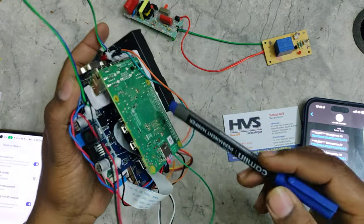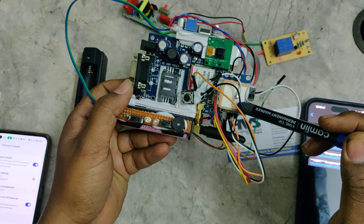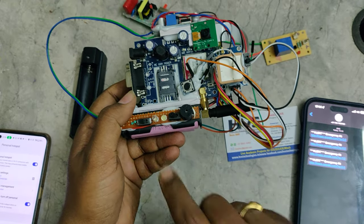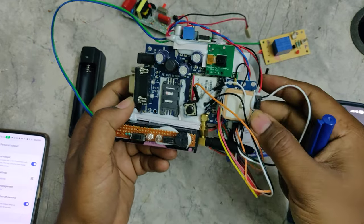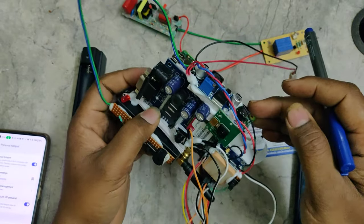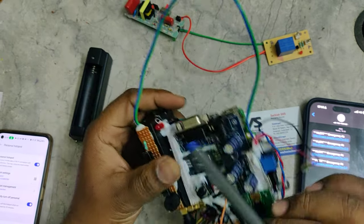All these operations are done with the help of the Pi 4 model. We have interfaced the Pi camera, GSM module, GPS module, and switches. The switches are used to turn on the flashlight and the buzzer. For interfacing connections, GSM is at pin 14, GPS at pin 15, and the flashlight at pin 2.